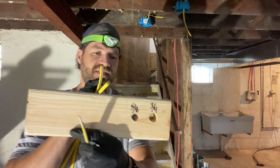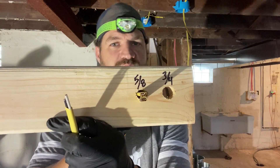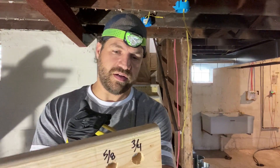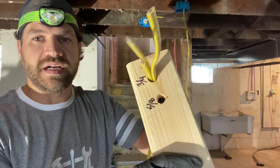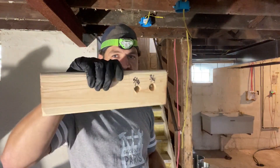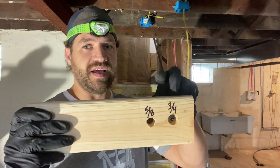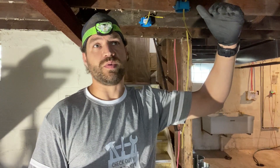With a five-eighths hole you can fit two wires — there's not a lot of extra room, but they fit. If you're running just one wire, a five-eighths is actually a pretty good hole for that. With the three-quarters hole you can run three wires. Keep in mind spade drills dull pretty quickly, so make sure you have multiples. This way you won't have to drill as many holes through all the joists.